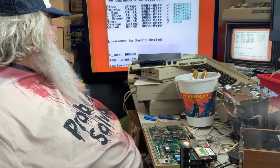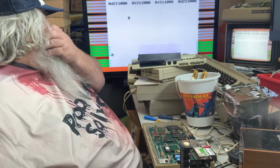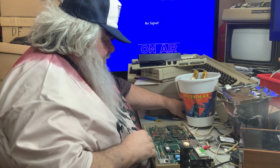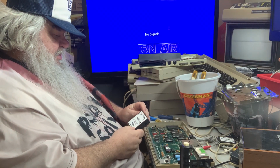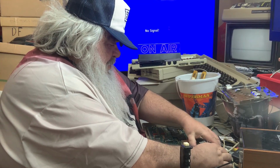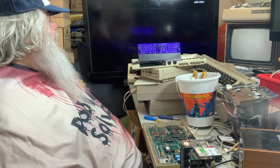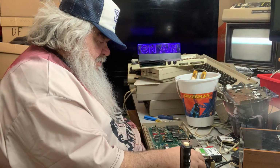Okay, so definitely it's pointing to a RAM something. But it is sticking there. Interesting. Let's take this out, and we'll put in the 4-in-1 diagnostics. We'll pick dead test number 1. Computer is off. One, two, three, 4. Okay, very good. Now, I'll press the reset switch, flip the switch to the second dead test, let go.